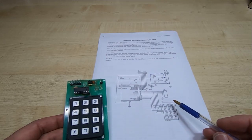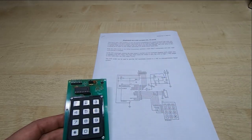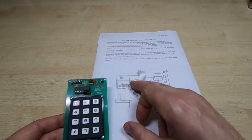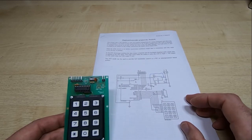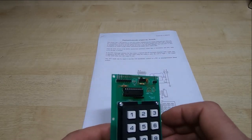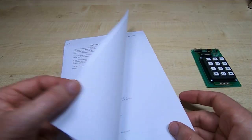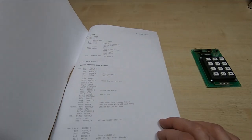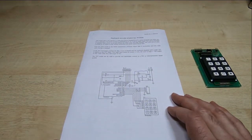So what we'll do is go through and see if we can figure out what's going on. I'll start by fitting the LED and see if it comes on when we power the board up. We'll do the basics — check the supplies are getting to the PIC and see if the outputs are doing anything. We suspect the PIC is not programmed. I don't have a programmed PIC or a binary file, but luckily the code is in the actual instructions. I only have this as a PDF, so we'll have to cut and paste or type it out into a suitable program.